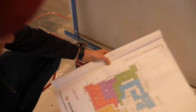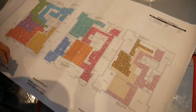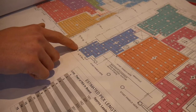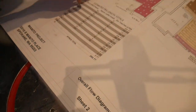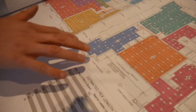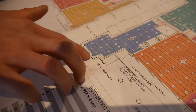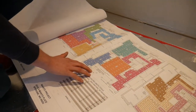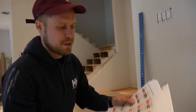EcoWarm is actually going to send you AutoCAD drawings that lay out each floor. There are a couple of really important things to know here. I like the page that shows you the tubing route and the directions they're going to be sending the flow. What you'll find is this isn't always 100% accurate, which is okay. I stopped stressing about these numbers. If you get the cuts right and you're able to follow the routes in a way that makes sense, it's not too bad. Don't stress if you get to a place where you say you actually don't need a tube here because it's a little bit different on the actual job site — that's just fine.